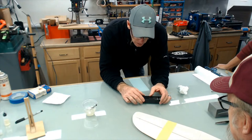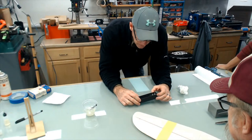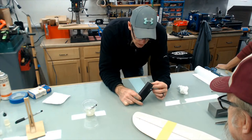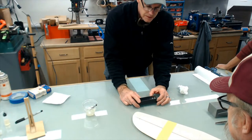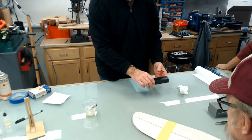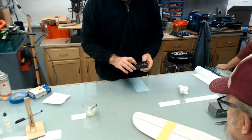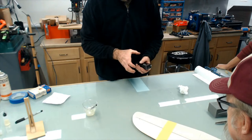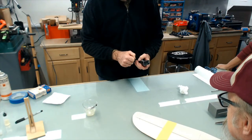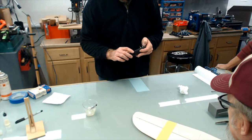So if you could physically clamp the tape out here and wrap it, and clamp it here so it wouldn't move. I think he's making a piece two or three foot long and just cutting the pieces out of a big long one. Oh, yeah. Instead of making one tank, it doesn't take much longer to make a section this long. Basically, it's just a long tube and you slice it up. But the advantage of aluminum is it expands a little bit while it's heating up, and then once it cools, it shrinks and self-releases the part. Well, that's what we need to get it.